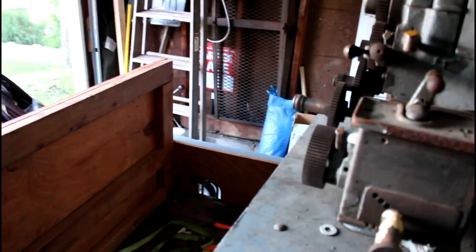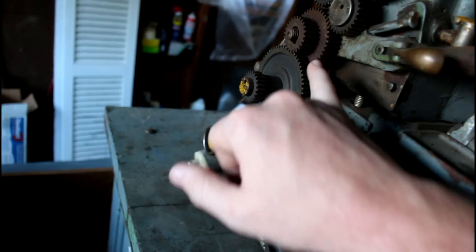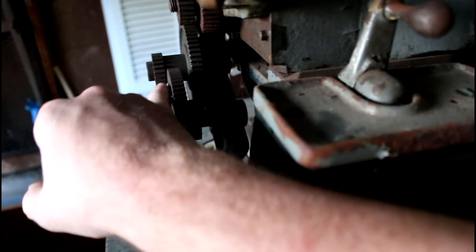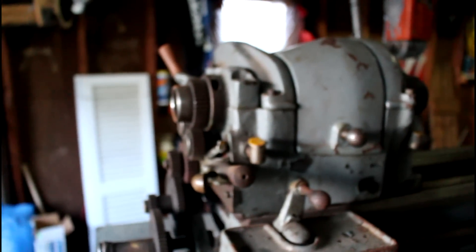You can go over and look here - the slide gear is kind of nifty if you've never seen one of these work. Here's the slide gear - you see we've got our tumbler and our spindle, the tumbler goes to an idler gear and then another idler gear. Here's our slide gear between our gearbox gear and our gearbox. It's kind of like your back gears - you're going little to big and then back here you go big to little. Slide it out - little to big - slide it in - big to little. Kind of cool how that works.